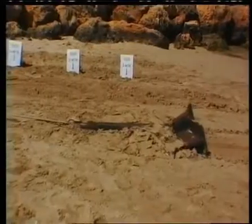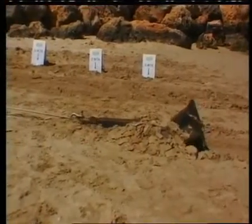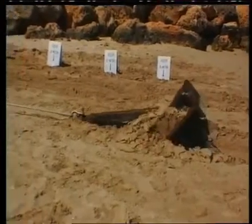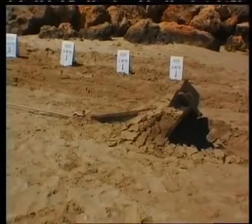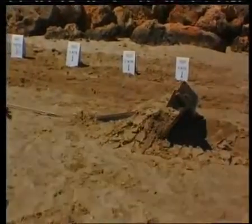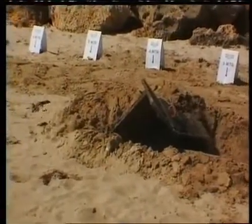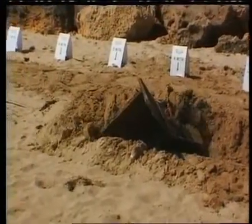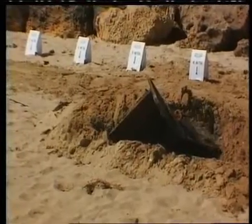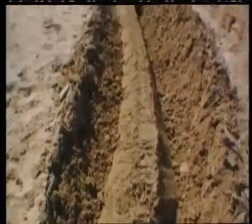The 160 kilogram Poole anchor behaves in a similar manner to the Danforth and drags for 1.5 metres, then stands up to begin burial. The load after 1 metre had reached 310 kilos and had increased to 980 kilos by the 2 metre mark. The maximum holding power of 1,180 kilograms was achieved after 3 metres. At this point, the anchor became unstable and began to roll out, resulting in a significant reduction in holding power. Again, there was a large amount of soil disturbance, but little or no discernible penetration.